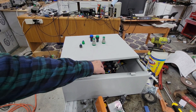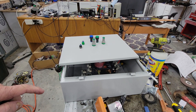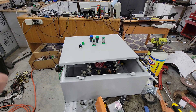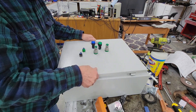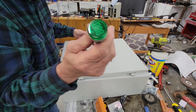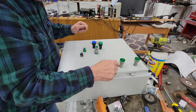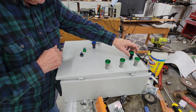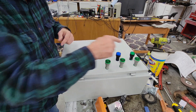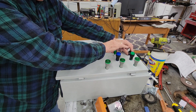This is my transfer switch — it's an automatic transfer switch, but I want to be able to select which input I want. I figured out the wiring needed to do that. I'm going to wire this up so I have a little voltmeter telling me what voltages are coming in on the grid, from the inverter, and the output going out to the house. Then we have a lamp here and a lamp here to tell me which one is selected.